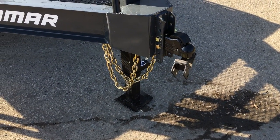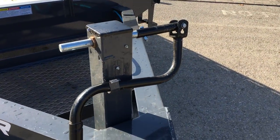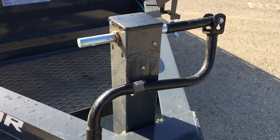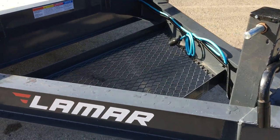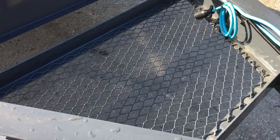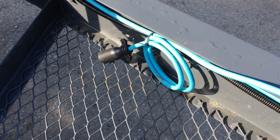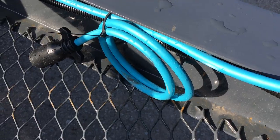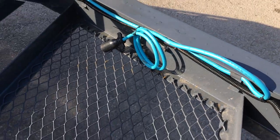It's also got a built-in safety — you can put your quarter inch snap ring in that and go on down the road. It has a pretty decent set of safety chains. Of course, the 12k jack up front has a pair of grease zerks for serviceability. They give you a little chain tray up front for putting your straps or binders or whatnot. Also, there you see the sealed wiring harness. Not only is it sealed, but it's also blue, which means it's a cold-weather rated harness.